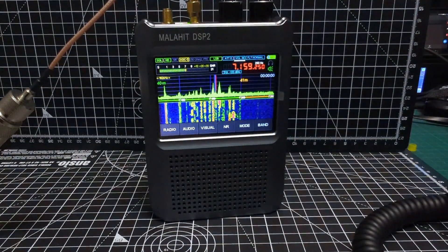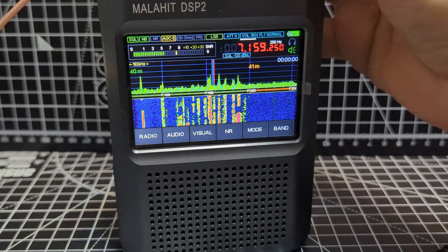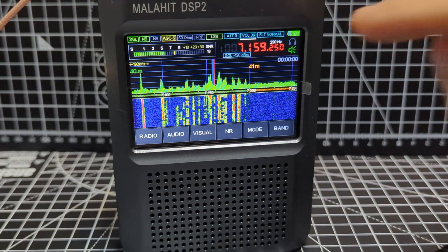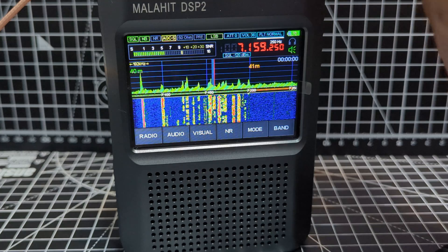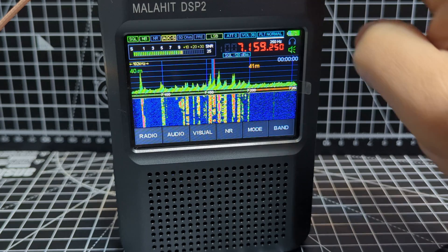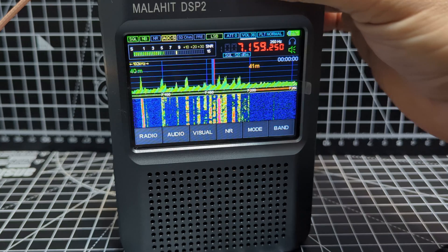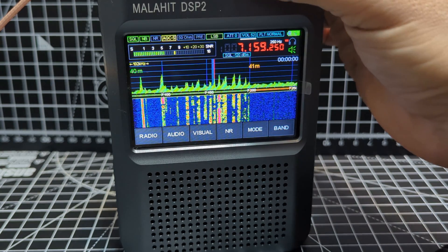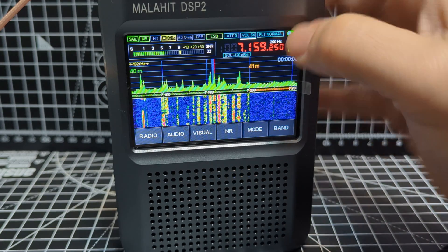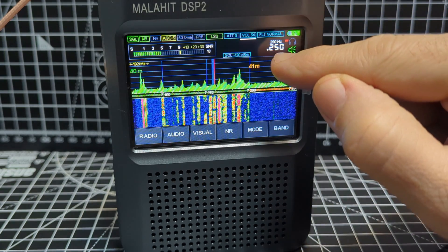Let's have a quick tune through on HF. To select the volume, you've got this white line that you move when you push down on the volume button — the middle black one — and it goes like a circle. Filtering is on normal. Squelch you do have to turn on. Then attenuation, then volume. And you can set the band step using the top right frequency button.